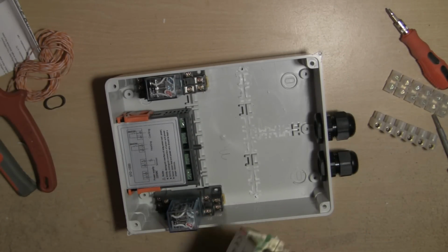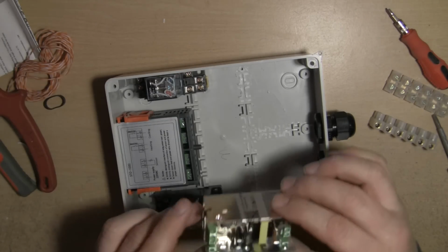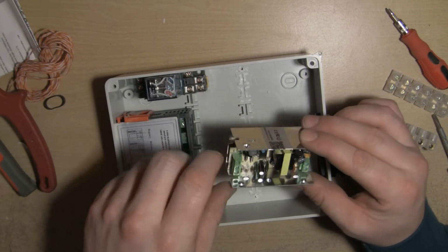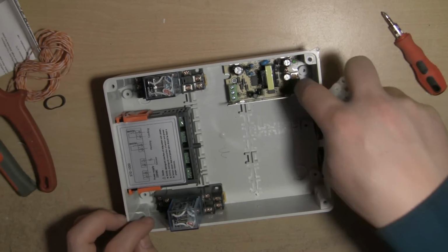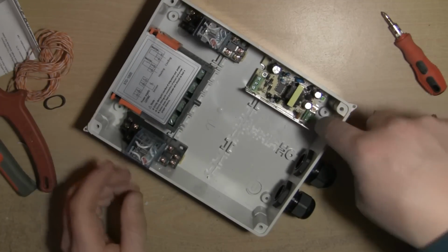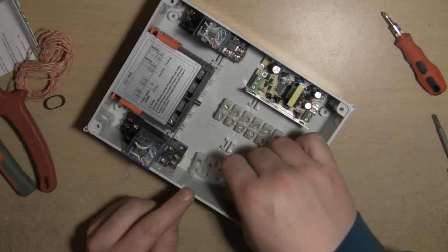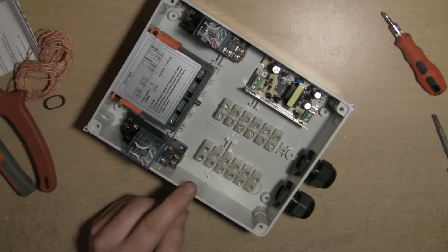And then we've got the power supply unit. So what I thought I'd do also was spin it around. So this is the 240 side. You can tell because you've got the rectifying bridge there. So we'll pop that to that side, and then all of this side is 12 volt, you see, and they're going straight out, so we're not crossing the 12 volt wires across the 240 too much. And then these two, that probably wants to come out.